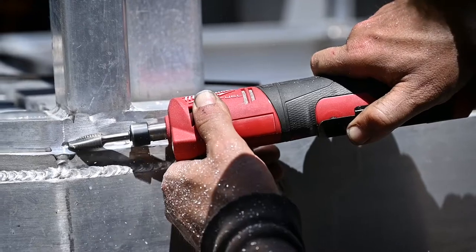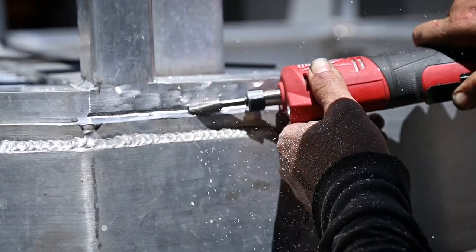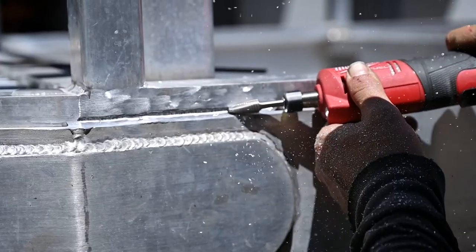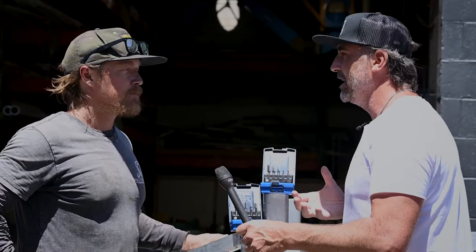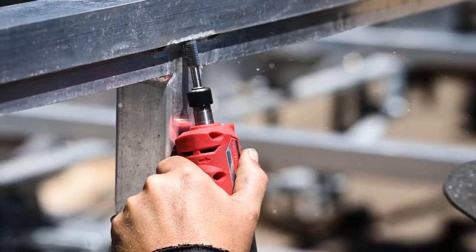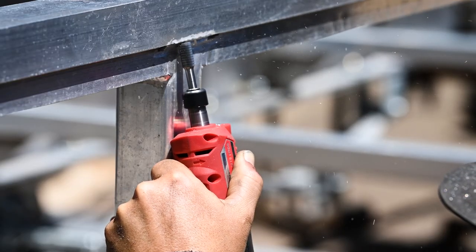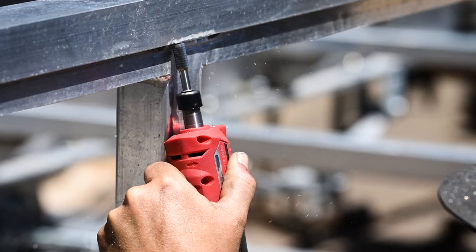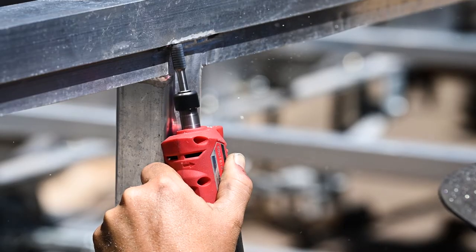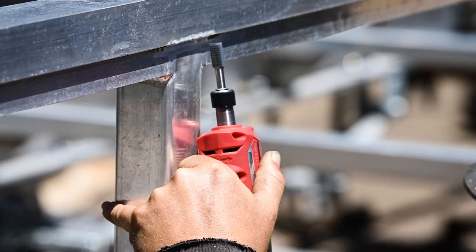These tools have been great - we can get in there and rip back the welds, not take them all the way back, but cut them into a corner and get them nice and flat so the external paneling can sit nice and flush. Starting with the all-rounds - that extra removal, you could really notice it. It moves a lot of material so you don't have to put too much weight into it. It mills the material really nicely - you get nice removal of the metal. You're not just grinding and gouging, it's actually a milling feeling, and you just move along really smoothly.